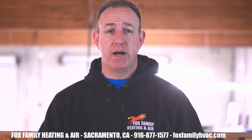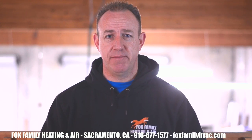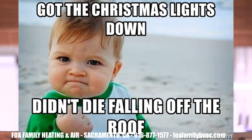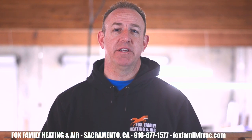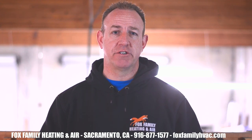You need to walk safely on rooftops. Don't step backwards — it sounds so simple, but it happens all the time, and even though it's often without negative repercussions, in a high-hazard situation like on a roof, it could be a critical mistake. Don't be hanging out on your cell phone either. It's bad enough walking around city streets accidentally bumping into each other for not paying attention to where you're going. Rooftops are no place for distraction.